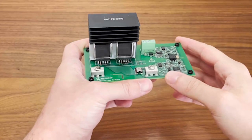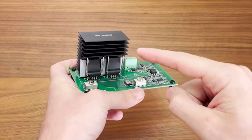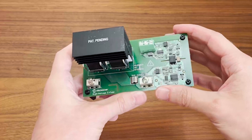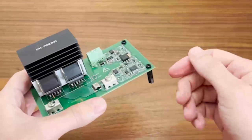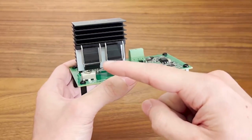The fuse itself is based on a pair of four-lead 1200-volt silicon carbide MOSFETs from Microchip. These are housed in TO-247 packages and they're strapped vertically into a large heatsink that's there primarily for development purposes. These components, like all others on the board, are automotive grade. Silicon carbide has a wide range of unique properties that help it safely handle higher voltages and higher currents when converting or distributing power. One of its main advantages over silicon is its low on-resistance, which helps keep conduction losses in check. Other qualities include a high tolerance for heat, as well as high thermal conductivity. Notably, these devices have a positive temperature coefficient, so you can place them in parallel without one hogging all the current.